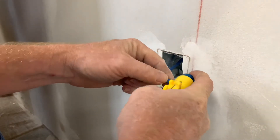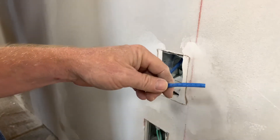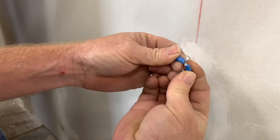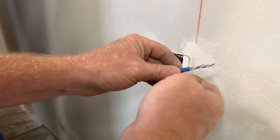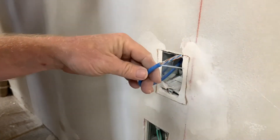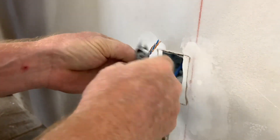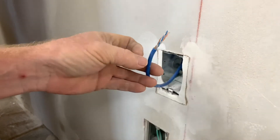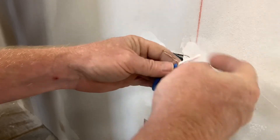When I do this right here, I'm not really cutting all the way through the jacket because I only go one time around. So I have to pull it back and you can see it ripping. I'm not hitting that wire on the side. Some people like taking this, pulling that string back, cutting it open. I'm getting down in there, but I don't cut it deep enough. I've checked it many times to make sure I wasn't hitting the wire — I'm not even getting close. So I'll peel that back.